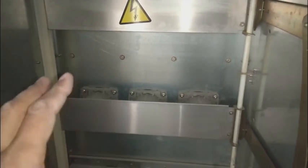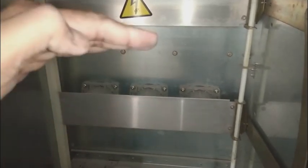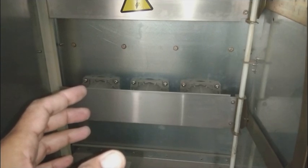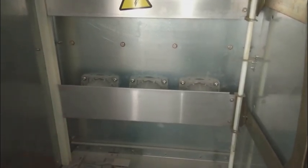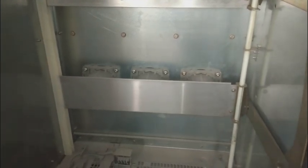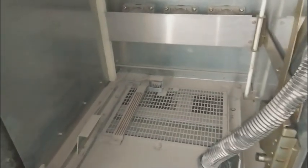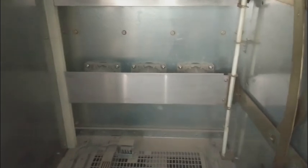In between there is the circuit breaker, switching on and off and carrying power. That's why they have put these plates — this is a safety feature. When we put in the circuit breaker, these plates are removed; they go up and down, and then the circuit breaker makes connection to the 6,000 volts. This is a safety measure for the person working on such a trolley so they will not be electrocuted.